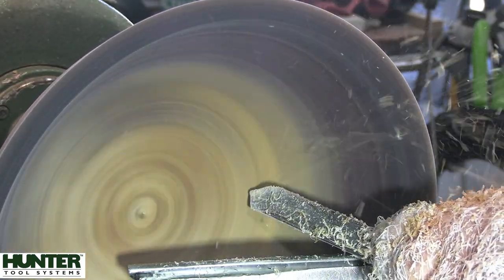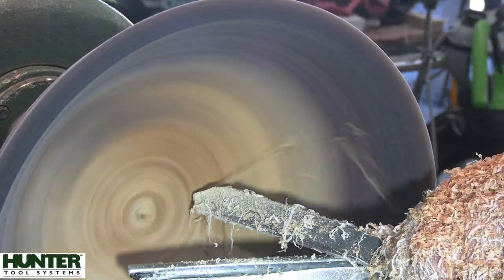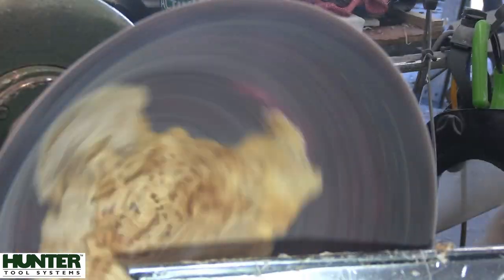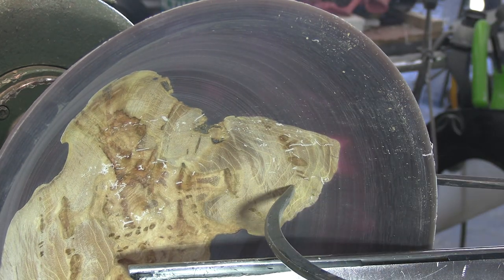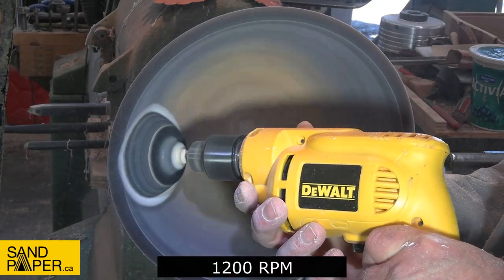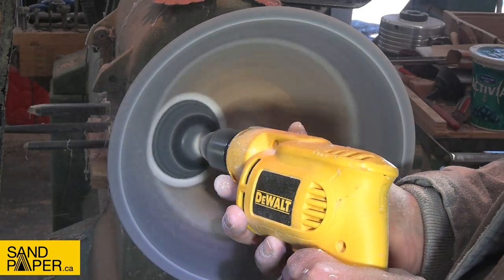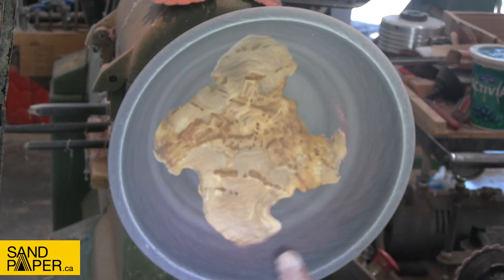Taking some last few little finishing cuts before moving on to sanding. That area right at the center of the bowl - because the surface speed is going a lot slower than the outside surface speed of the bowl, it's tough to get in there and get kind of tool mark free prior to sanding. But it did a pretty decent job there. The reason I use this drill is because it goes 2400 RPM. Spin your lathe at 1200 if you can and the drill on full at 2400 RPM and you'll get a really clean surface.